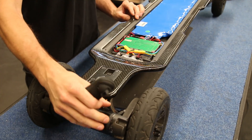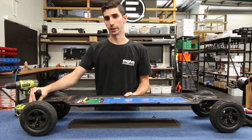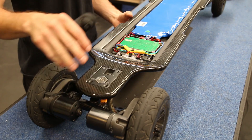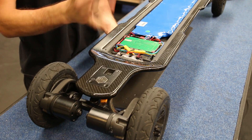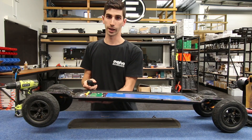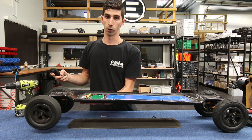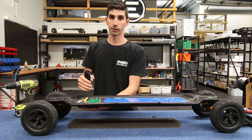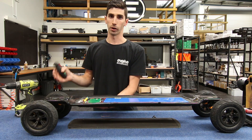If before the exercise your right motor was not working: if it was a motor fault, that same motor would still not be working. If it's a motor controller fault, the left motor would now not be working, because it is now using the output from that motor controller that was initially for the right motor. If you lift the board up in the air and test them — because both these motors are fine, as you can see they're both operating. However, because they're receiving the opposite signals from both the power and the hall sensors, the motors are operating in reverse.